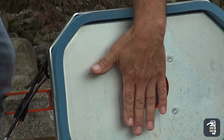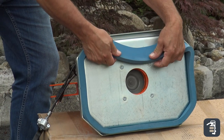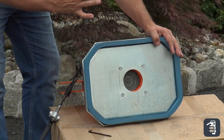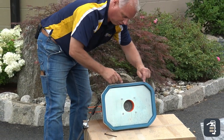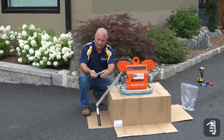The unit is completely assembled on the bottom. The pad is easily replaceable — it is just a press fit. One thing when you are checking this unit out, or if you are having any issues on a job, make sure that you do not have any variation in height or being sucked in one spot, or any tears or rips in it. The bolts use two washers and a nylon locking nut.